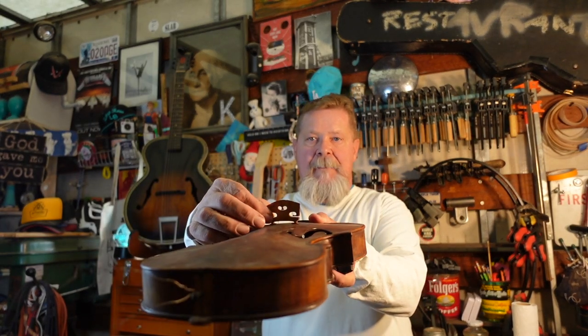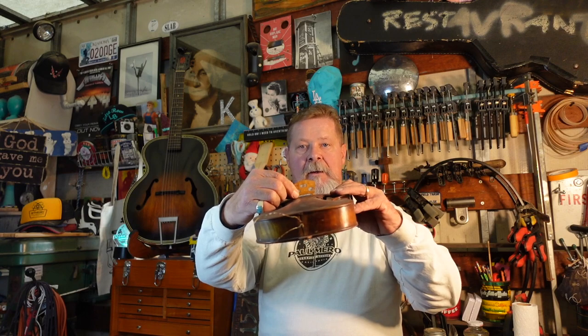This violin would have a bridge about this big — you see that? It sits up off of the deck of the violin. It fits the violin perfectly; it has to. If the feet don't sit right and you load this thing, it's going to develop cracks right here — remember, this is really thin. When you load the bridge on a violin, you're pulling and bowing, not just plucking. There's only a certain level of loading you can get on a guitar in comparison to a violin. When the string is released, it releases the vibrations — they go inside and come out the F-holes.